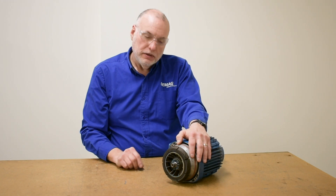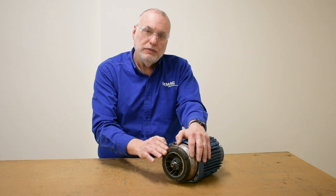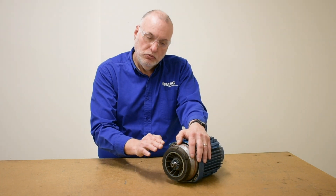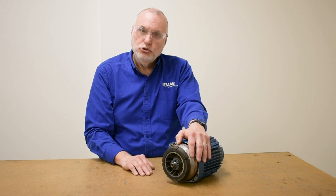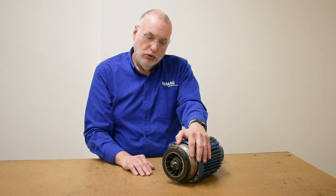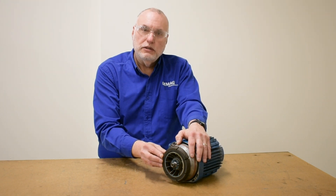It's important to remember the outside taper should be 21 degrees for smaller motors, size 200 and under. It has to be 20 degrees for the size 225 KB motor. This is critical because it will not mate with the other metal lining surface if it's not true to that angle. We recommend on the KB 225 that the assembly be purchased. If only the ring is purchased, you should remove the carrier disc and take the assembly to a lathe before you reinstall it on the motor.